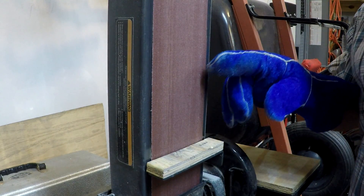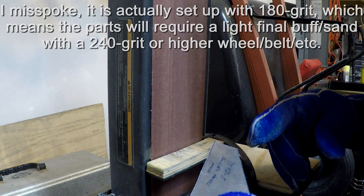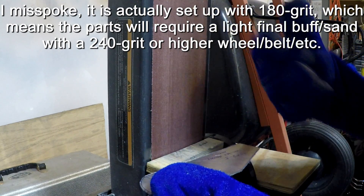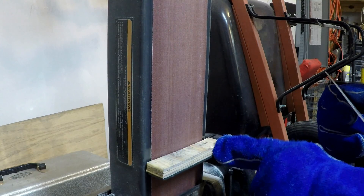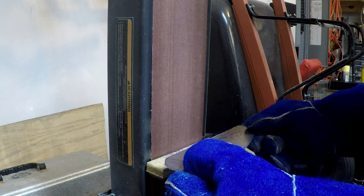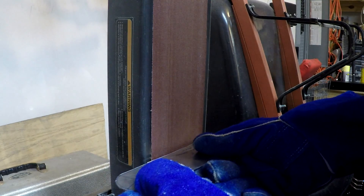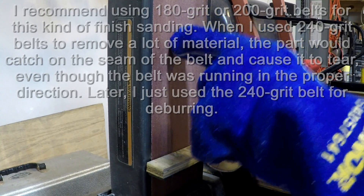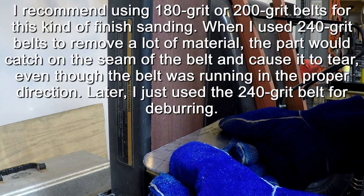This is already set up with 240-grit paper, and even though I'm using such a fine grit, it's going to chew this material off very quickly because we're using the entire width of the paper across that section, so it doesn't load the paper up nearly as quickly. I've got the sanding fence set up with a piece of wood on it like I've shown in a previous video. I'm going to draw this across using the same kind of method - not hanging out in any one particular spot. You've got to use a higher grit of paper here; if I put 80-grit on this I would chew through this part and go well past the line in probably milliseconds.